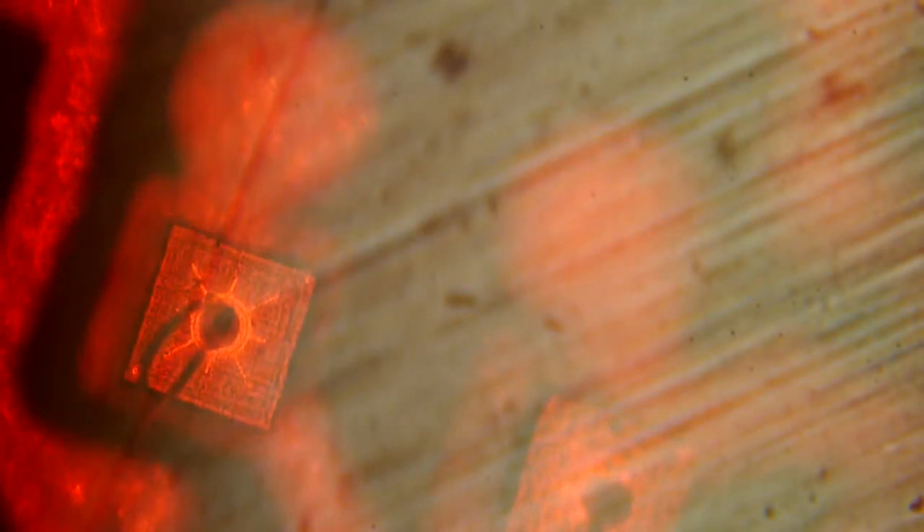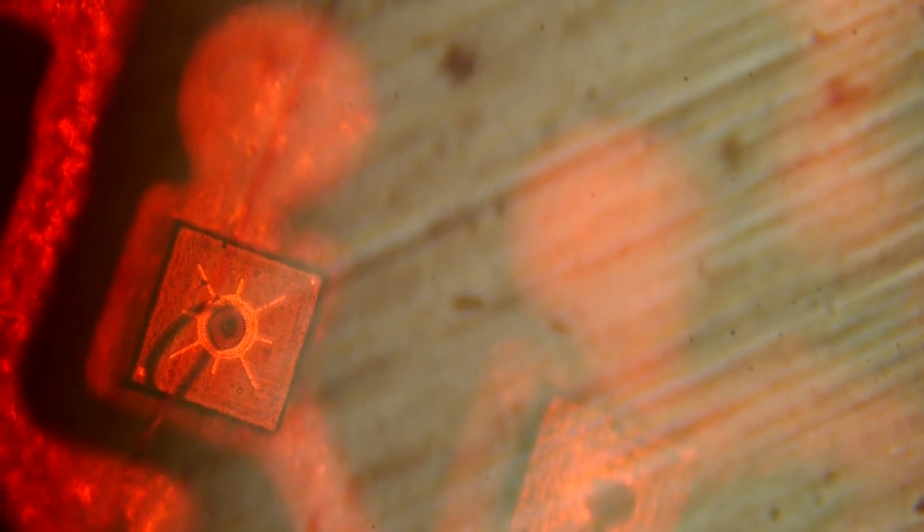Under the microscope here, it looks like we're getting a lot of glare off the front top of the plastic. Maybe on the left-hand side you can see one of the LEDs. Let's focus on that one. You can see the little bond wire on top and the metal mask on top of the LED to spread the current out — so that's one little square LED there. There's a good picture of the bond wire and its shadow.